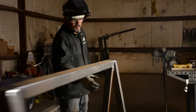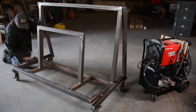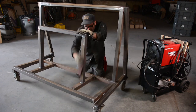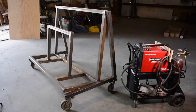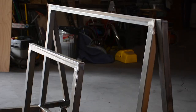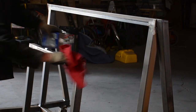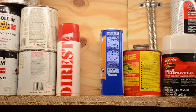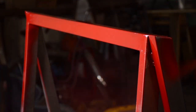Everything's ready to go. I'm going to take it for a little ride — those wheels are great. They're about $30 to $50 a piece if you had to buy them; I found them in the street. Now I'm using the red Scotch-Brite to clean off the surface rust, then blow everything off, and then use acetone to give it one clean wipe-down. Acetone gets it nice and clean, and I get it ready for spray paint. I'm using Rustoleum, which I don't typically use, but I wanted a high gloss and I like the high gloss of Rustoleum.